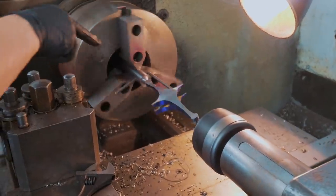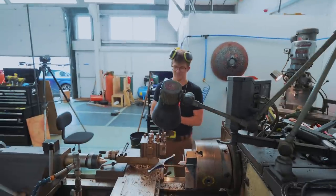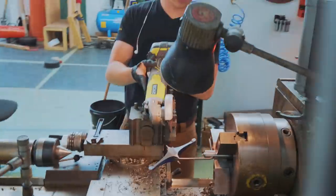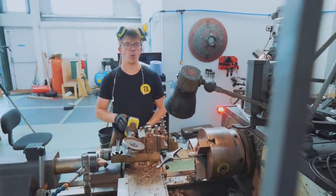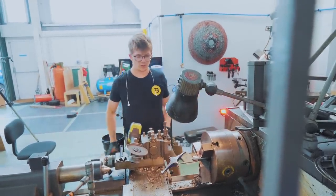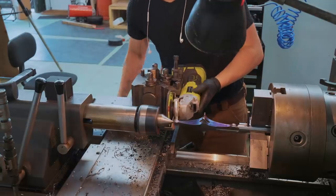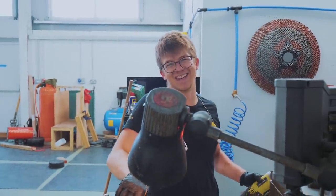So you can see, despite the fact that it's only held with a point here, it's now spinning. The idea is that somehow, somewhere, in such a way that we grind it into a ball, or at least a circle. Obviously, I can't put the lathe cutter on it because it's not well supported enough. I'd love to be smart — oh, there we go. Look at that. Interesting. This is going to send sparks in my face. I'd probably be done by now with perfectly acceptable accuracy if I just did it on the grinder.